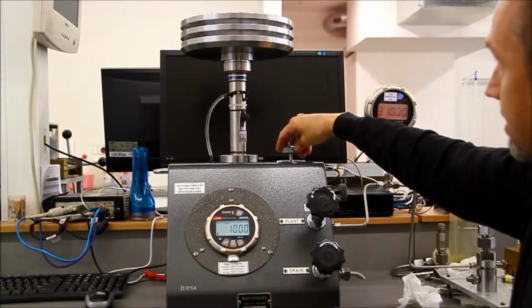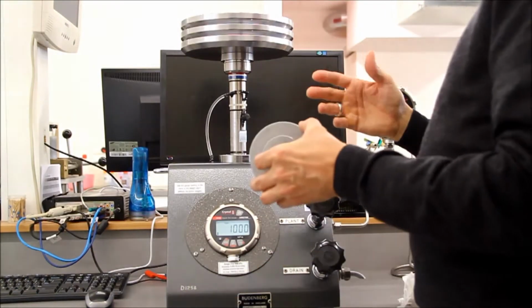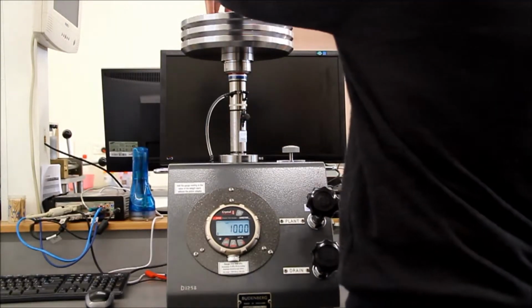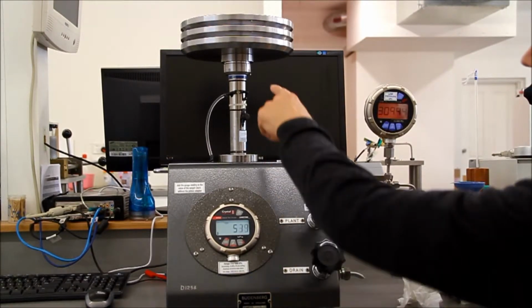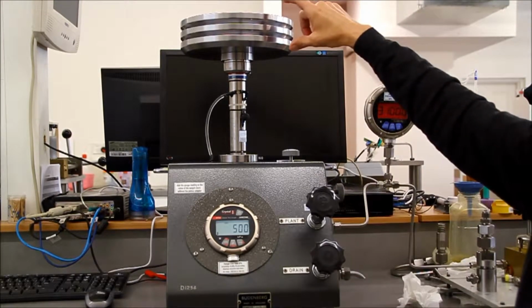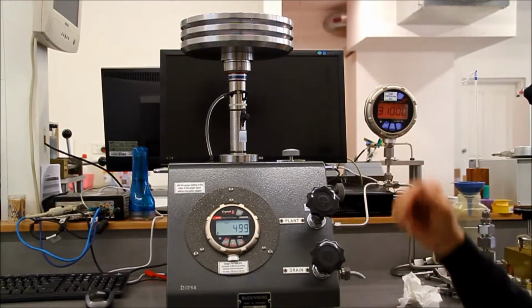To take a reading, currently we have 30,000 kPa of masses loaded on top of the piston and its adapter. I would tend to put on between 250 kPa to 750 kPa of mass. In this case I'll put on an extra 500 kPa of mass, which will drop the piston to the top of the blue band. We will then close the reservoir valve and apply some pressure to the circuit to refloat the piston into the middle of the red band, and after letting some readings stabilise, we can see we have a pipeline pressure equal to the 30,500 kPa of masses loaded onto it, plus the gauge reading of 500 kPa, which is 31,000 kPa, which is near to what our line pressure is.